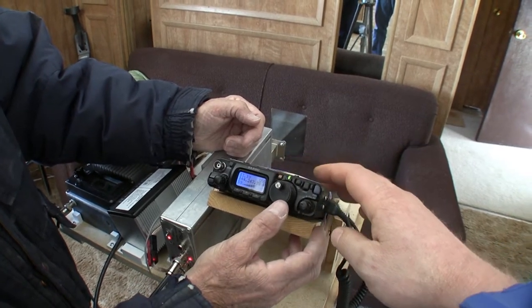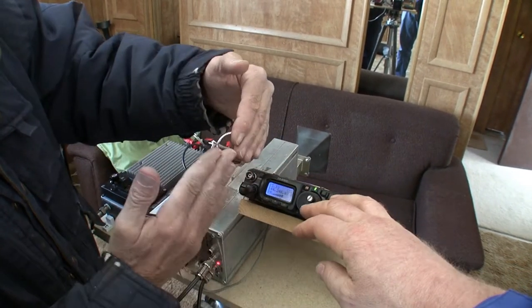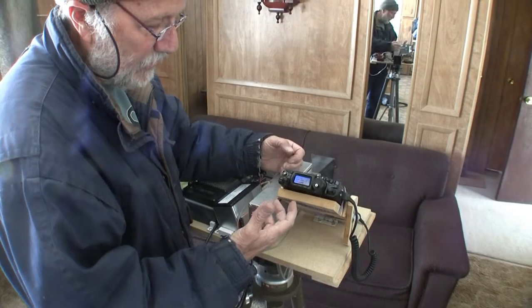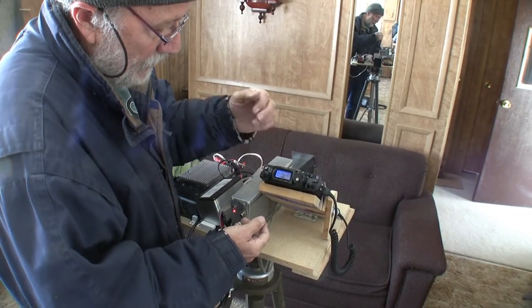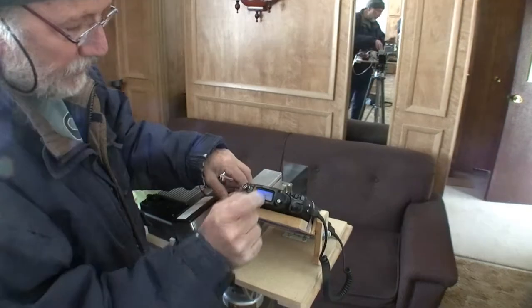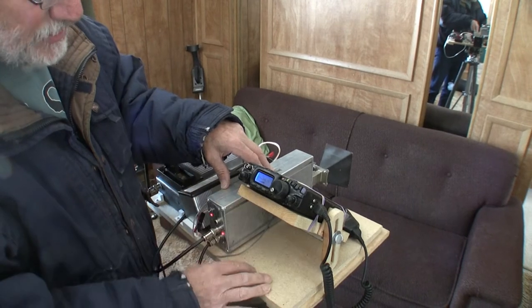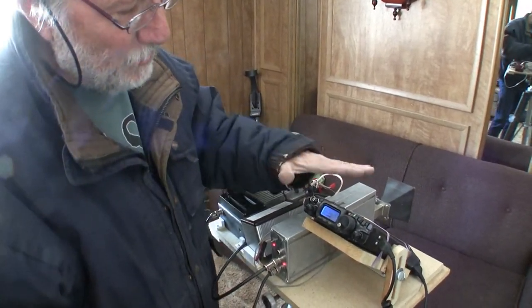If you tune it in just right you'll hear code, but it'll be kind of inverted, so it's actually using two frequencies. We do this for two reasons: first, it keeps the transmitter always transmitting, so you don't get a stability problem from the transmitter warming up when on and cooling when off. Second, it's much easier to implement — you just put a little voltage on the oscillator pin, it's dirt simple. This frequency-shift approach is pretty standard on beacons. We don't shift too far or you get chirp and use more bandwidth, and we have precious little bandwidth on 10 GHz.